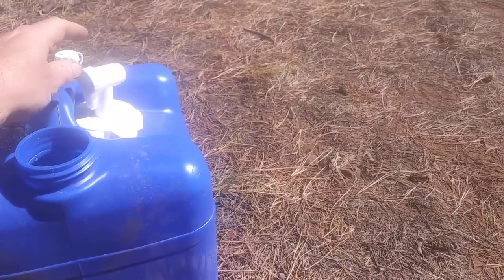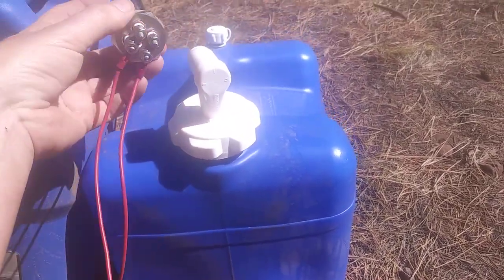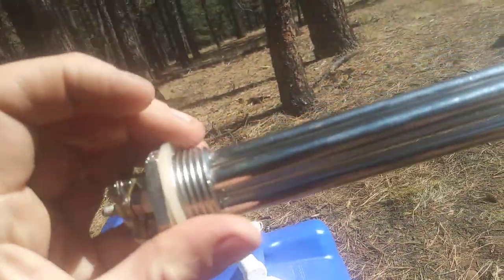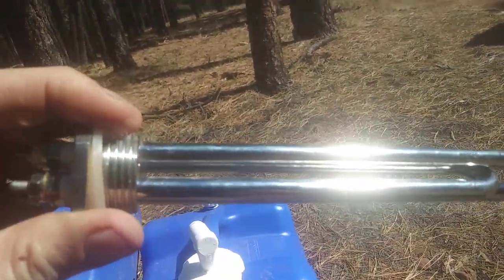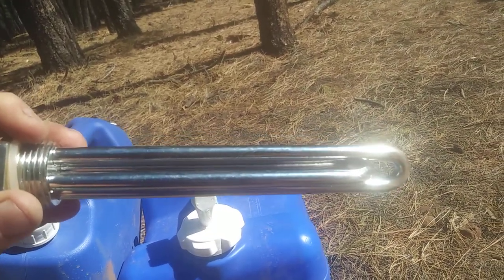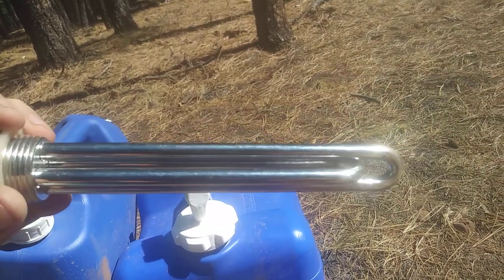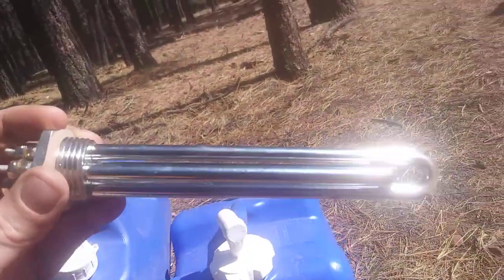I haven't had any shorts or anything dropping that straight in the water. It's actually designed — if you see the threads here — it's designed to thread onto a pipe. If you could screw this into a pipe, then you're not putting the element in the water, which is probably how it was originally designed. Then you'd want to run it like a feedback loop with the water and have a drain where you can drain the hot water out of the piping system.